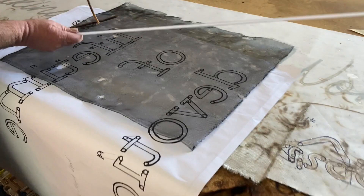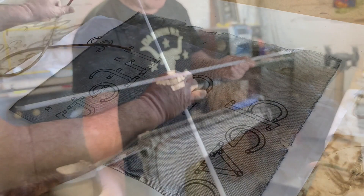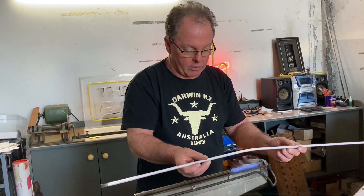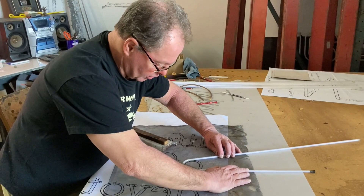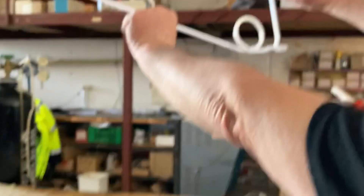These are little graphite pencils — they're fantastic, they ride on anything. From here I just want to get this halfway around. I'm just heating those two sides. Glass doesn't conduct heat, so otherwise if this was steel I'd be burning my fingers off. This is quite a simple bend to start with, just back and forth. The only reason you're blowing is the tube collapses a bit like bending a hose. You mark it, and that's where you're going to try and do the bend. There you go — here's your first wonderful piece.